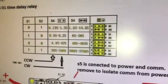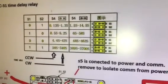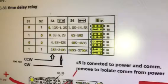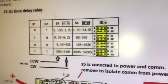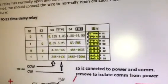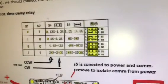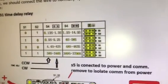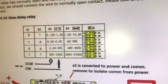There's also an S4 strap as well. It's a combination of how you strap S1 and S2 and whether you have S4 strapped or not — that gives you different delays for this timer. If you do anything other than the specified combinations, you get spurious activity: it kind of works but then stops working after a while, which will be a bit of a curveball for you.